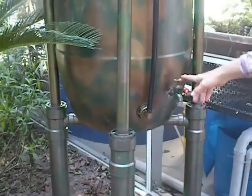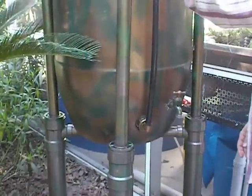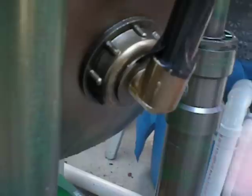The city plumbed it for a faucet which is very effective, but I put some bulkhead fittings in here. I found some clear PVC. If you bring that around over here you can see — these are the bulkhead fittings right here. This is PVC, a 90-degree with thread threaded into the bulkhead. And this is clear PVC.